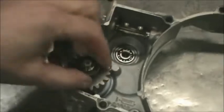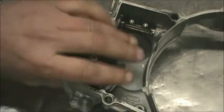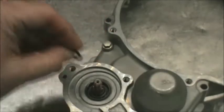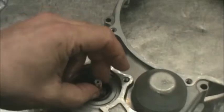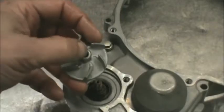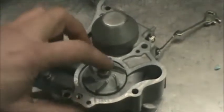I went ahead and got my drive unit in, put my clip back on, a little retainer — thrust washer, whatever you want to call it. On this side we're going to install this washer, and then I'm going to put the impeller back on. I'm going to use red Loctite on the inside of this. Tighten this up to 10 foot pounds.